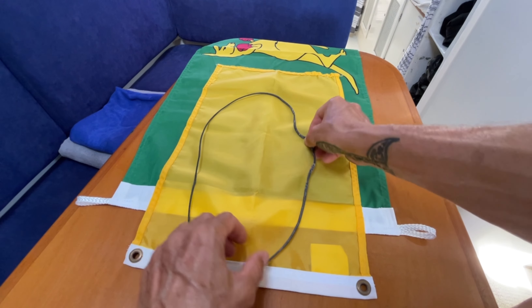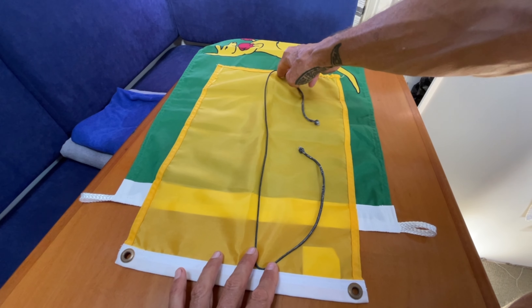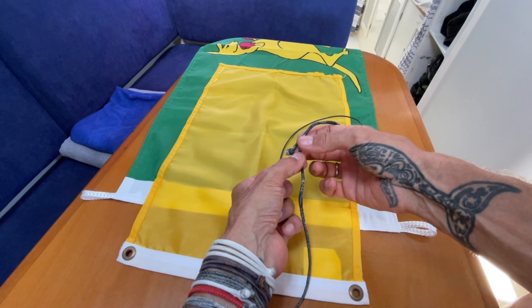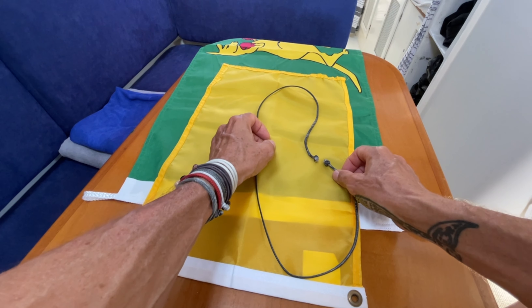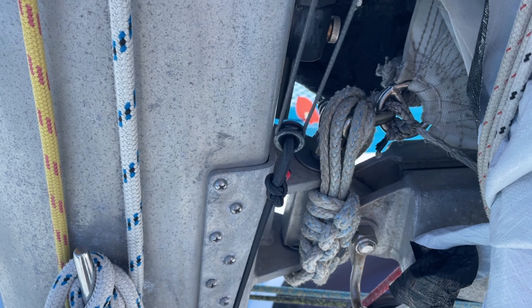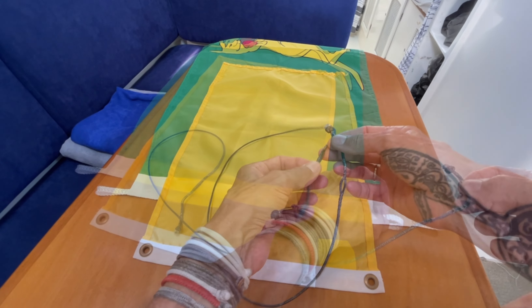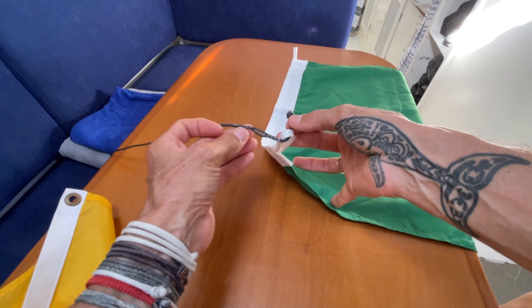I'll show you how this is going to work. The flag halyard runs from near the gooseneck where the boom attaches to the mast, then up through a pulley or small block just on the base of the first spreader, and back down. Normally it's just two ends of rope — you tie a bowline to each end and fix the flag halyard to a small cleat at the bottom and tension it like that. But what we're doing is using shock cord at the bottom and a really small friction ring to keep the luff of the flag halyard under tension. Instead of tying bowlines or using little metal clips, we're attaching it through the base of the flag.